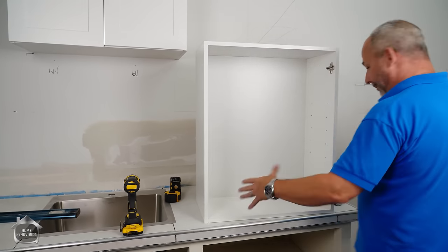Okay, you might find that you're in a really funky old house and the walls are everywhere and you just can't level your cabinets perfect. So you've got to make them look like they're perfect, but they're not level. In those situations, you might want to use a laser level, or you can just drop a line across all your cabinets with a laser on a stick like I have. And don't worry about if they're all in the same spot on the cabinet door. When you're putting in, here, let me show you.